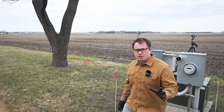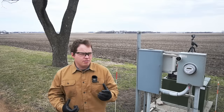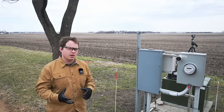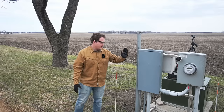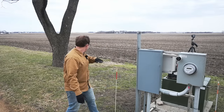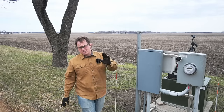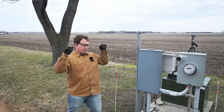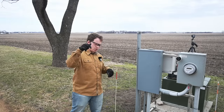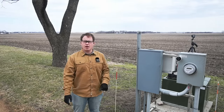For the first video in this series, what we're going to be doing is pretty interesting and can clarify a lot of myths that are out there around grounding. What we're going to do ultimately is connect a hot wire of 120 volts directly to that freshly driven ground rod over there in the yard, and then we're going to see what happens. Will that breaker trip instantly? That's kind of what the conventional knowledge would be — electricity wants to take the path of least resistance to ground.